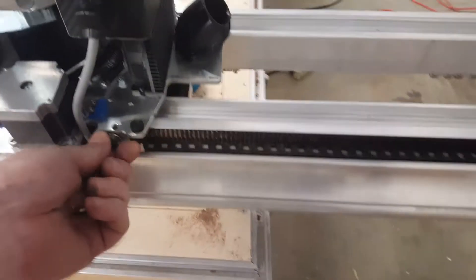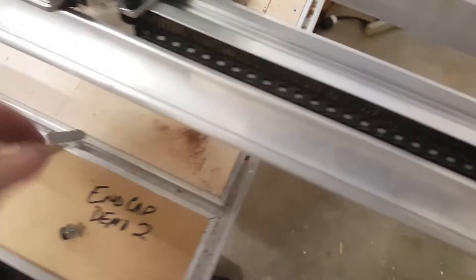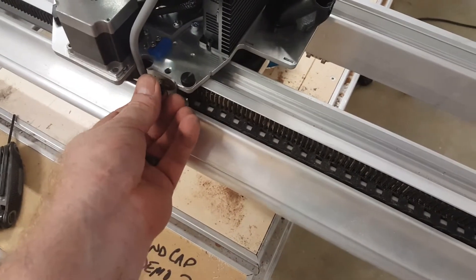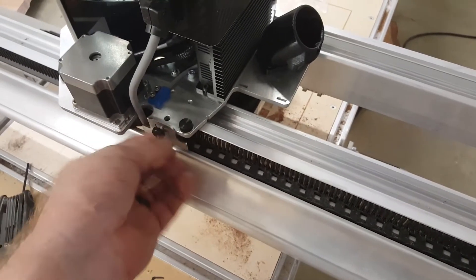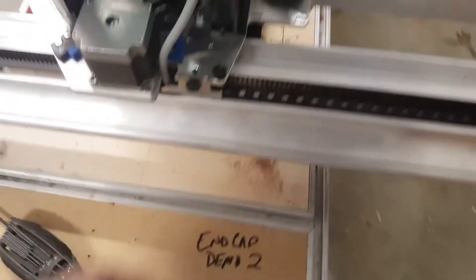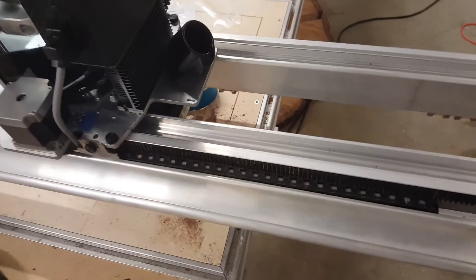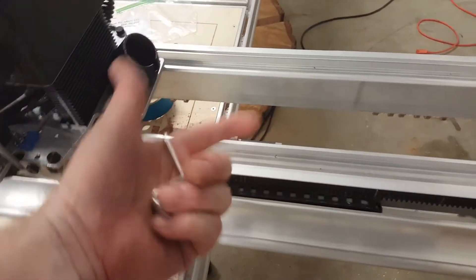Both sides went on, but my old fittings didn't work — the thumb screw that came with the new head is a little different and smaller. That's because it's a different base plate, so you need to use the right one; that's why the old screw wouldn't thread properly. I'll throw the old ones in my gear bag. There's no slop — as I wiggle and jiggle it there's no movement in the Z-head on the X-beam. The X-beam isn't fully secured since I'm not cutting material, but I'm good to go.